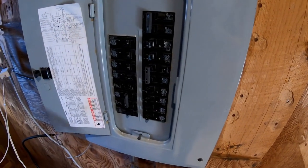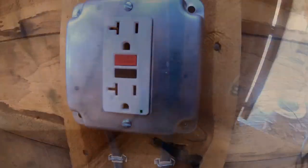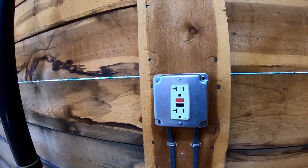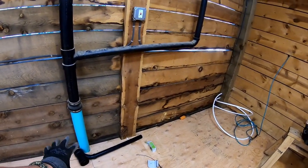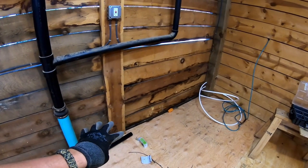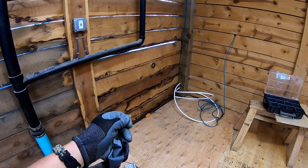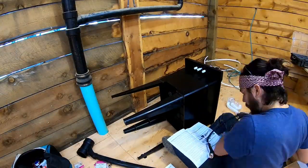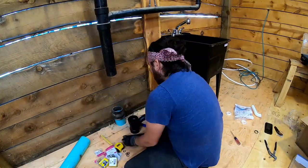The panel's back together, we turned on the main breaker, and we'll flip on the plug. Green light means it's protected — no fires! Looks like the plug situation is set. The sink is going to go right about here, wherever the trap and drain and hoses allow. I'm going to get it roughly in place and rough in these PEX-to-wall-mount adapters and cutoff valves for the sink. Let's get that sink installed — that'll close up everything and we can test the water, and that will be the last task that finishes this little shop upgrade.